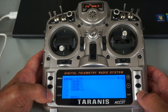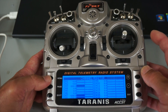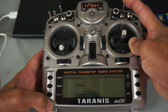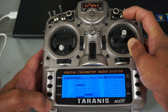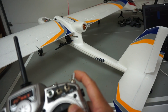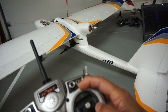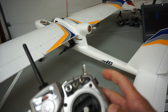I haven't configured any of the endpoints — all I've done is selected it, then scroll all the way down to make sure the source gets picked up, and that's really all you need to do. This is a three-position switch, so the middle position doesn't currently do anything. If you read up on the inverted flight channel, it needs a value of over 1750 to engage inverted flight. Looking at channel 7 right now: middle is at zero, all the way down is at 100, which means roughly 2000 PWM. By default I'm going to take off in manual mode with that set up, then switch into fly-by-wire A mode for stabilization, toggle the SC switch all the way down for inverted mode, and then back into normal flight mode.